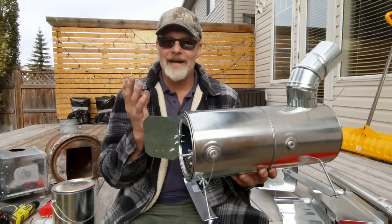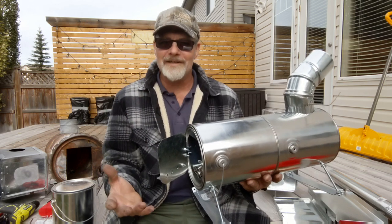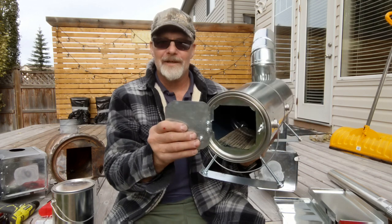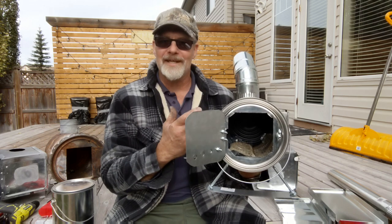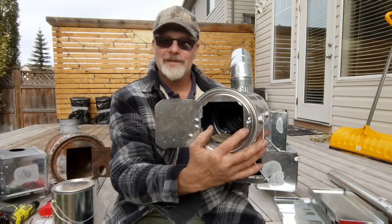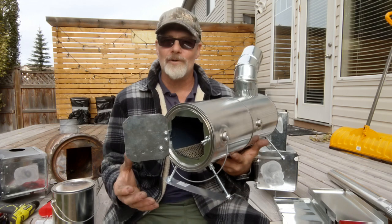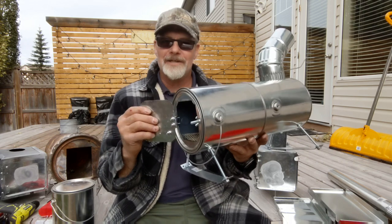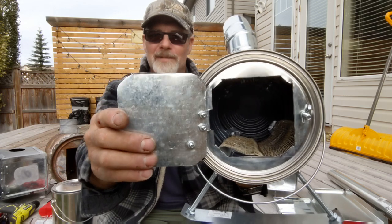Now I'm sure a lot of you are wondering how I joined these two things together. There's no hardware on the outside, so obviously I did it from the inside. I'll just show you the front. I cut a hole similar to this one into the back of the front can and also into the lid of the back can, and you can see a little bit of extra meat here on the four sides. I basically just bolted them together — quarter inch bolts with wing nuts — and then once I had it aligned I trimmed out a little bit of excess to open up the inside as much as possible.